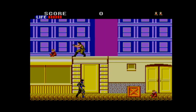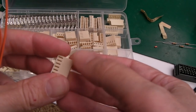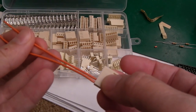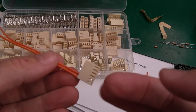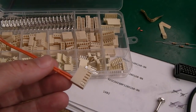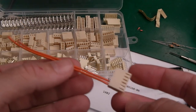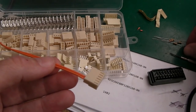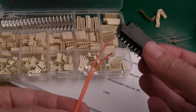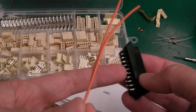The first thing I'm going to show you is quickly throwing together a video connector to get RGB out on the Mega Drive side, since we haven't seen video on the Mega Drive side yet. These are Molex connectors, 2.54 pitch, and it's a full kit with six-pin connectors I need for the video connector. At the moment we've got one soldered on with no resistors. Whilst my TV is quite happy with that, you could damage your TV because it's probably outputting TTL level sync. I've got some 330 ohm resistors, but I'm just going to wire it up - it's just a short temporary extender, nothing tidy or presentable.